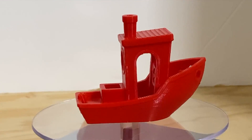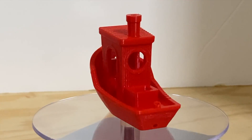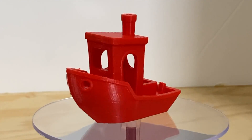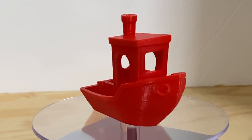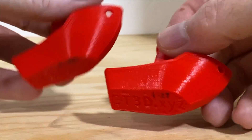After that, I sliced and printed a Benchy, which took an hour and 45 minutes and came out really good. Parts cooling seems adequate — no curling on the bow as it printed. Using the default fine 0.2mm settings, print times don't seem any faster than just about any other printer. But with the quick 0.2mm setting, the Benchy took an hour and 27 minutes — that's 21% faster. Both Benchies looked identical; I wouldn't be able to tell them apart if I hadn't written the print times on the bottoms.